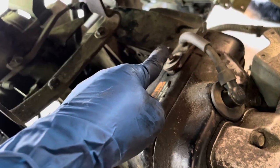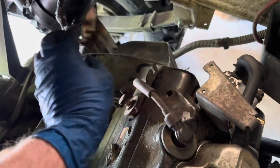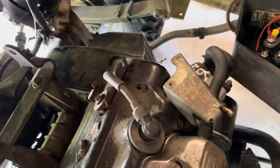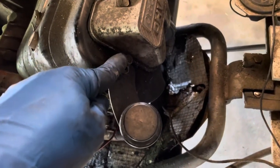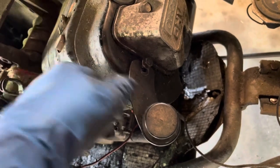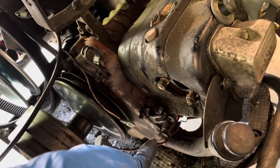The belt comes off and you move the starter generator — I just have it laid over on the side where the muffler would go. The muffler comes out of two bolts here and has a supporting bolt here, so I pull it out of the way. Then I pull my throttle cable off the carburetor. All my cables are undone, I'm unplugged, and there's one ground cable that comes to the oil spout motor mount — I've tucked that out of the way.